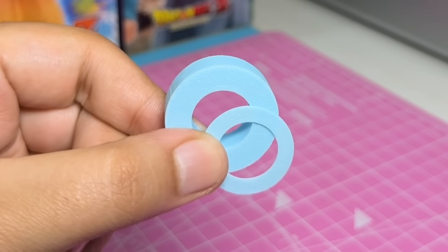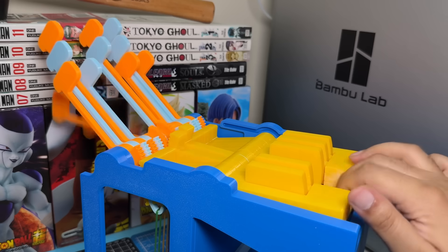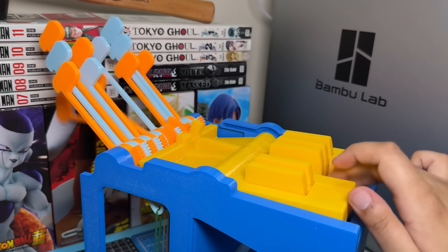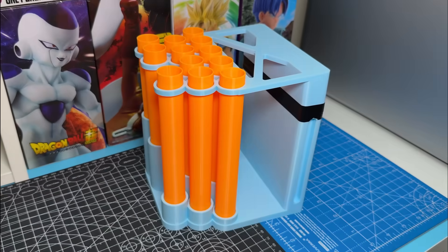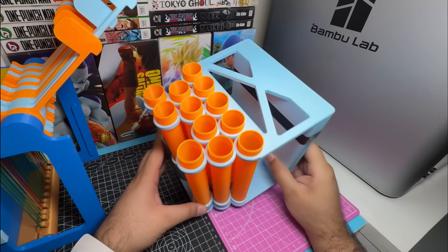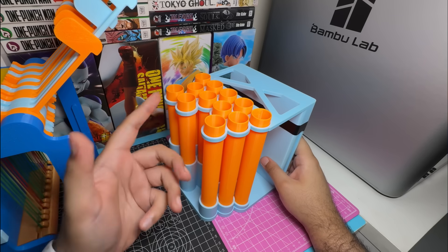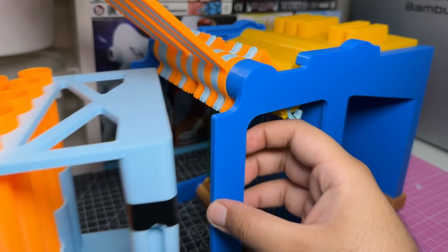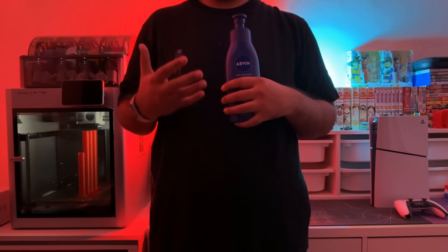I've had to add some spacers in between the hammers and the keys so that they don't directly rub against each other and jam up when you play notes quickly. The pipe assembly features an uneven arrangement that just happens to be the most space-efficient way to arrange the pipes. Connecting the two halves gives us the first playable prototype — so let's try it out.